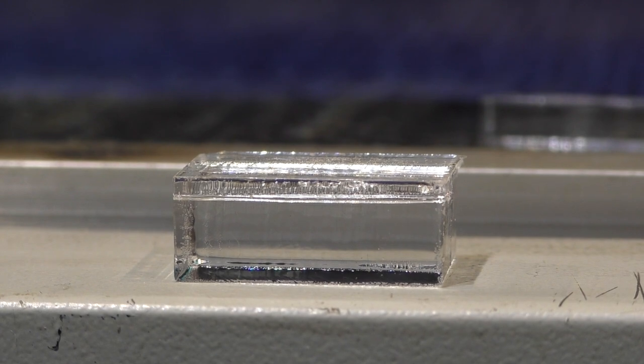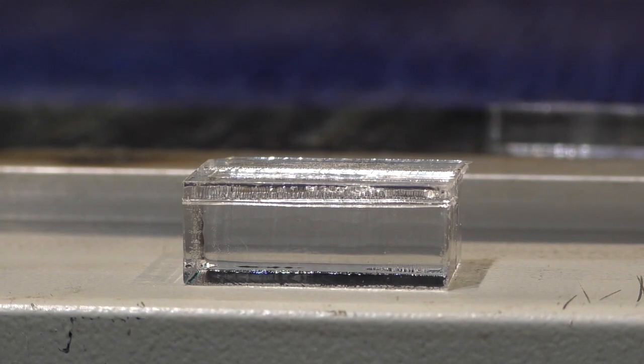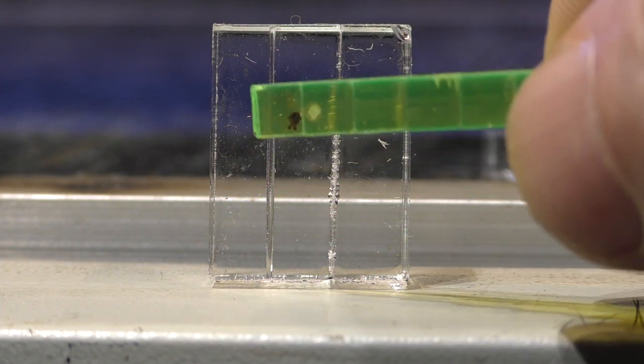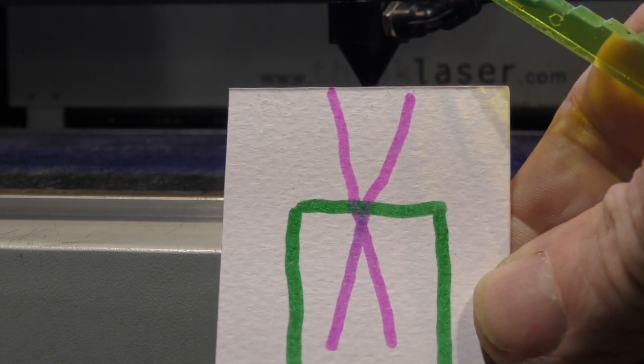So there is this distinct relationship between power and speed, which, as I said, you must think of as exposure time. Now, with this hole, I did give it enough exposure time to burn right the way through 25 millimeters of material because I wasn't moving the head. So that was one example of how the exposure time works. But the biggest problem with this example, this parallel hole, is why am I producing a parallel hole that thin when I shouldn't, because the beam is doing this?